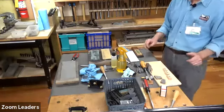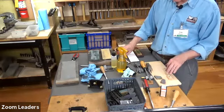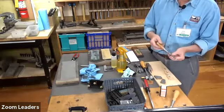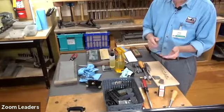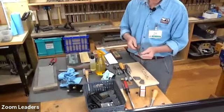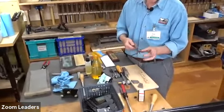Chisels, I've already showed you a little bit, but they come in different sizes this way, and then the bevel angle matters to people. As I said, these were 25 degrees when I bought them. I've switched to 30 now because they're A2 steel. If I had, this would be an old steel, probably an O1 steel, and seems perfectly happy at 25 degrees.